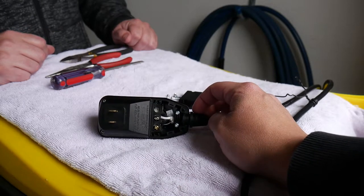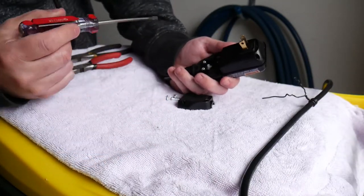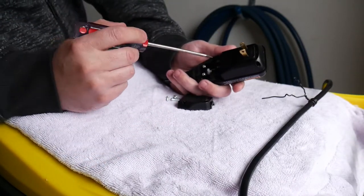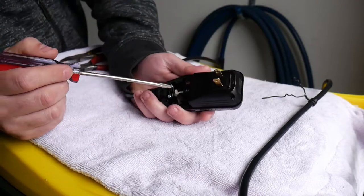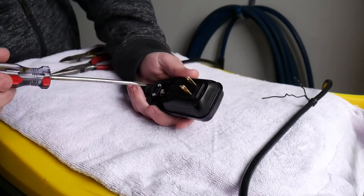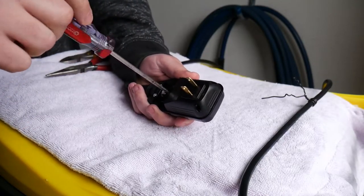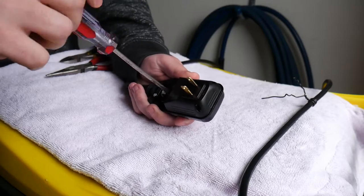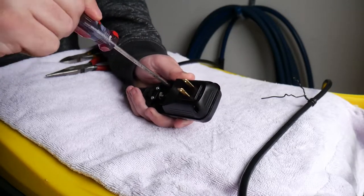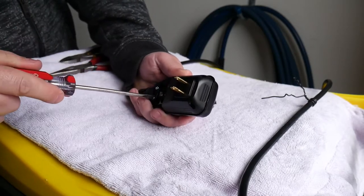What we've got in here are two wires: black and white. The black wire goes to the brass terminal, and the white wire goes to the silver terminal — you want to make sure you don't mix those two up. All you need to do is loosen these two terminal screws, get your wires free, and then loosen the retainer that holds the grommet in place.